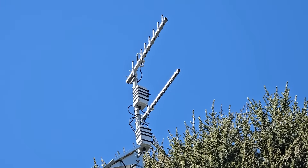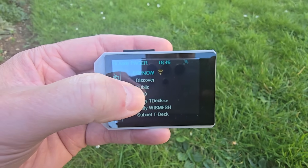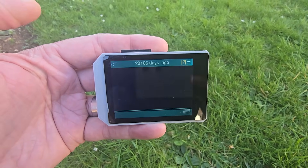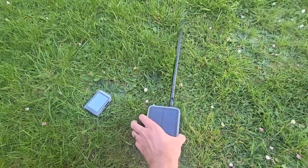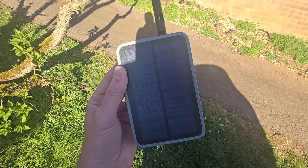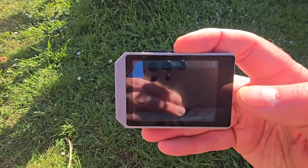If you start having lots of ESP-NOW MeshCore repeaters in really good locations, you could probably cover a really large area. I've been testing this — on my mast I've put up a 2.4 GHz Yagi at the bottom, and I've also got my little pager. I'm going to send messages to device 1060, the companion radio plugged into the computer. Because the pager's antenna is small and inside the case, I'm also taking an ESP-NOW repeater with me — a simple 2.4 GHz unit — which I'll drop on route somewhere to help range.